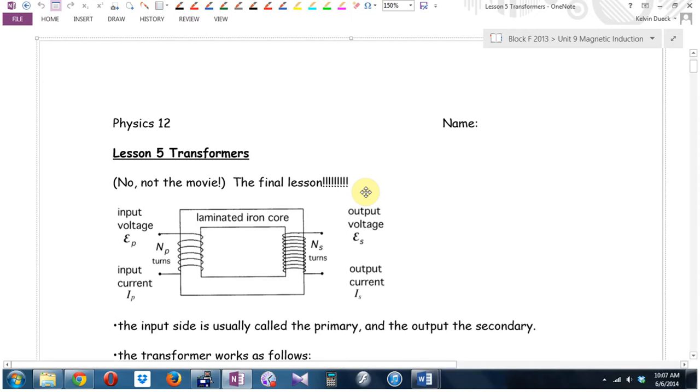But that's not the voltage that's in the power lines. In the power lines, it's around 20,000 volts on the telephone poles. And that's not the voltage that's in the big steel, 3 or 4 story, going-over-the-mountain power lines. Those ones are often at 500,000 volts. Why do we have these different voltages?